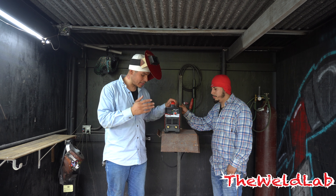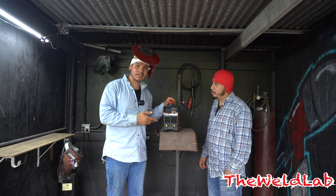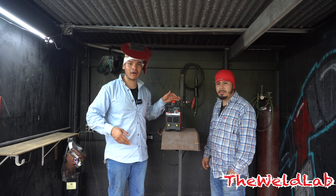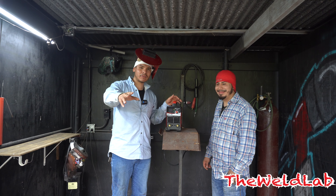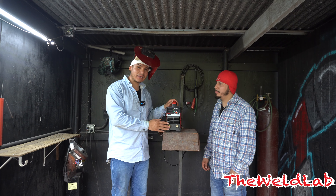If you're interested in this machine, I'm gonna be trying stick and TIG on it. You can run TIG — I did a previous video on a different welding machine and y'all were saying you can't run TIG because you need a foot pedal. I can tell you now, you've never been to the field. You do not need a foot pedal to run TIG. All you need is argon and switch the cables.